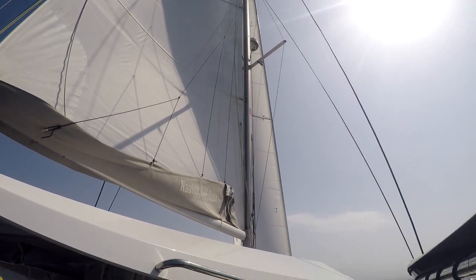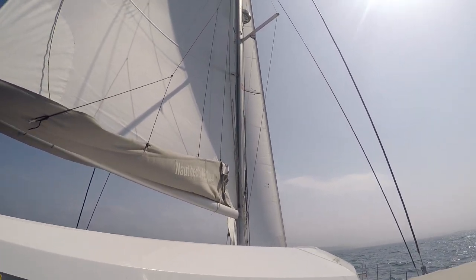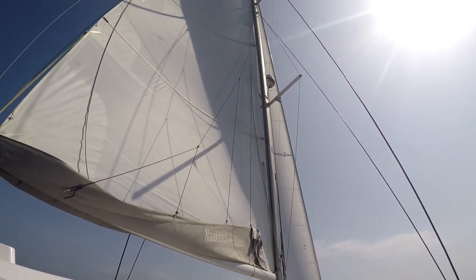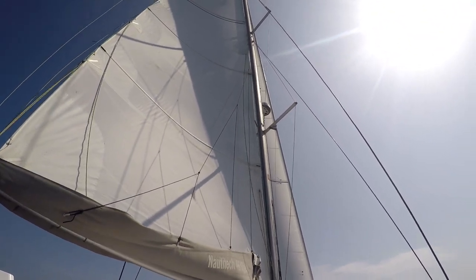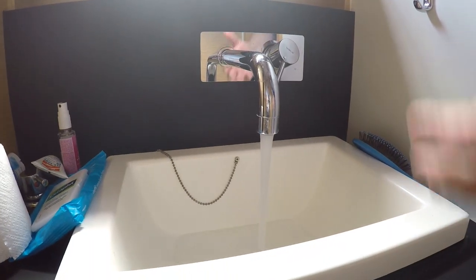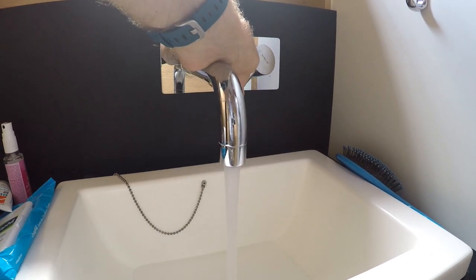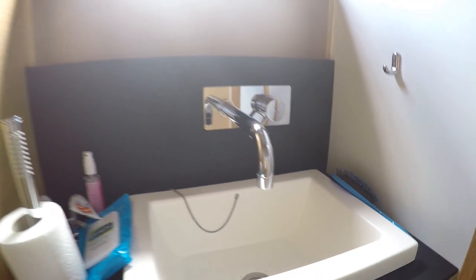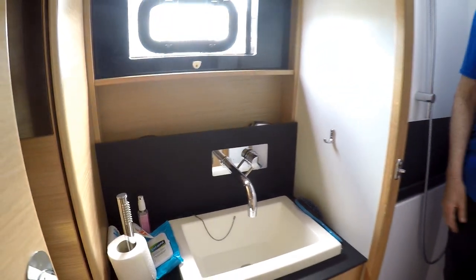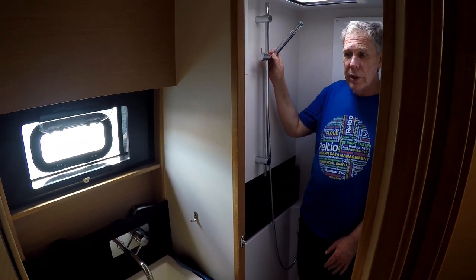The main halyard and the mainsail cars were absolutely horrible. They definitely need to be replaced with a ball bearing system. The water systems on the boat just were not great. The boat could really use a thorough going over from a water pressure standpoint, maybe additional water pumps, one in each hull, along with accumulator tanks would be good.